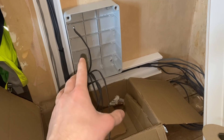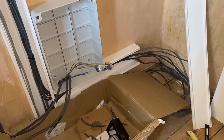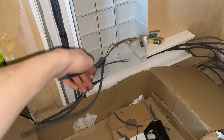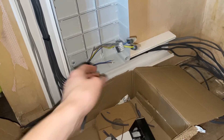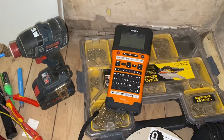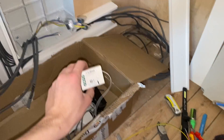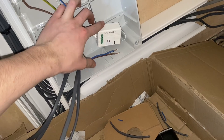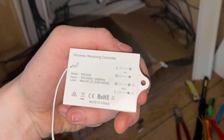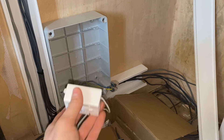Now I'm going to unpackage all the receivers, get them ready, and stick them in place. There's one shorter cable so I'll put that in the nearest receiver. We've got live, neutral, and earth here as our feed going at the top, and in each receiver a singular cable - just live and neutral since these are all Class 2. I've got the Brother label printer out - I've written 'Bed 1' for the master bedroom - and I'll wire in the live and neutral in the out position as labeled on the back: live in, neutral out, live out.